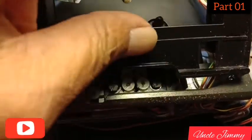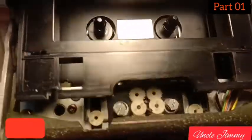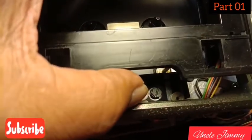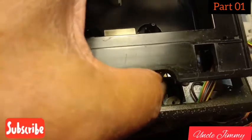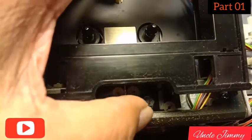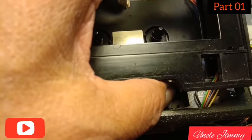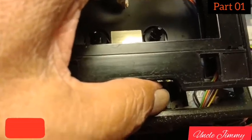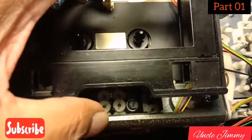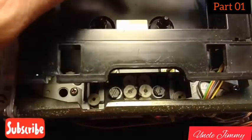What I've done is pulled one out from a few Nakamichi decks that use the same classic transport — possibly just permanently — to replace the broken playhead azimuth gear over here. When I get the new set, I'll keep those as future parts for future repairs.